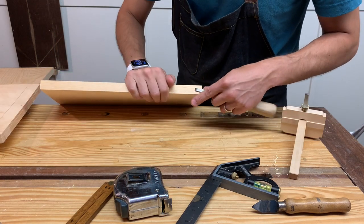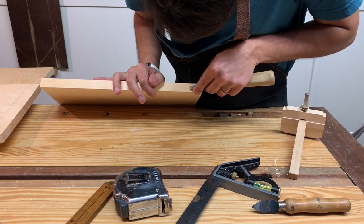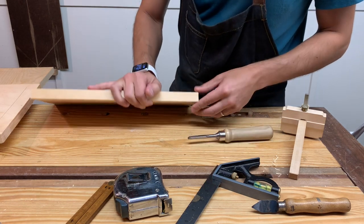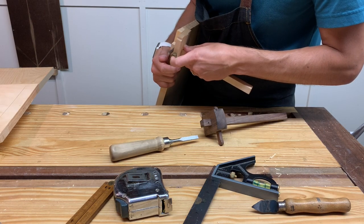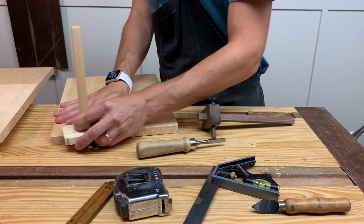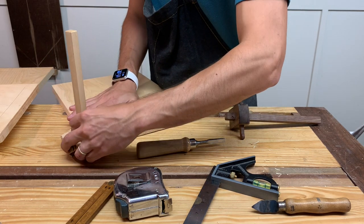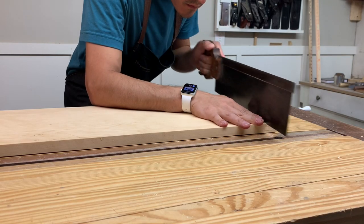Now I'm going to take the exact chisel I'll use to do the mortising, bring it up to the line I just gauged, and make an impression in the wood. That'll give me the thickness the tenon needs to be to match the future mortise. Then I'll bring a gauge up to that, a brand new one, and set it off the back side. I'll have to do this for each individual board, resetting this gauge. It's not that important, as long as it matches that chisel. Since a lot of the boards have varying thicknesses, even though it's straight off the shelf, you just can't be sure.